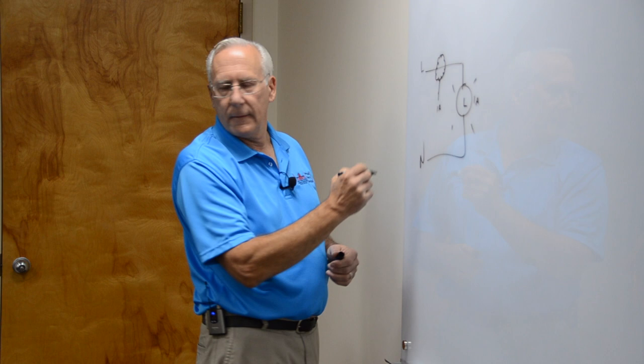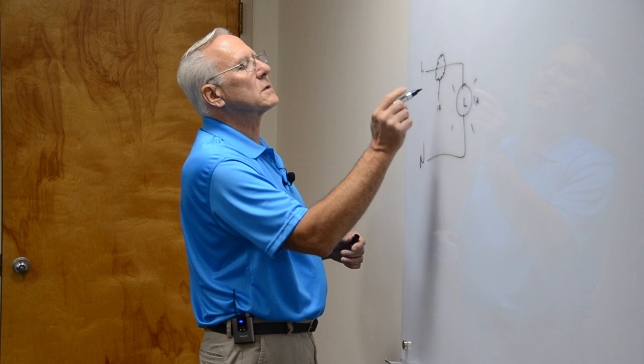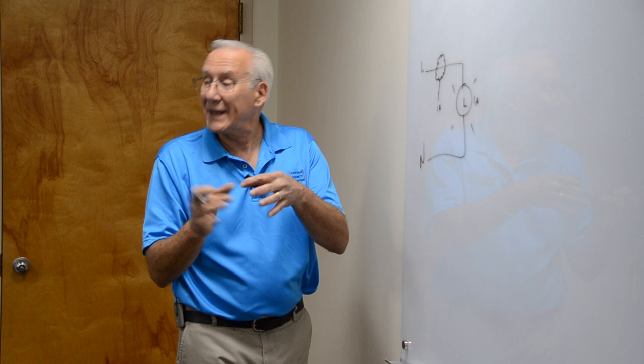Okay. And we'll get into that. We're gonna get into other diagrams like this to answer your question with the neutrals and everything. But an amp probe doesn't touch the wire, it goes around the wire. And it'll read the current that's in the wire. Can't see it, but it'll read it. It's there.